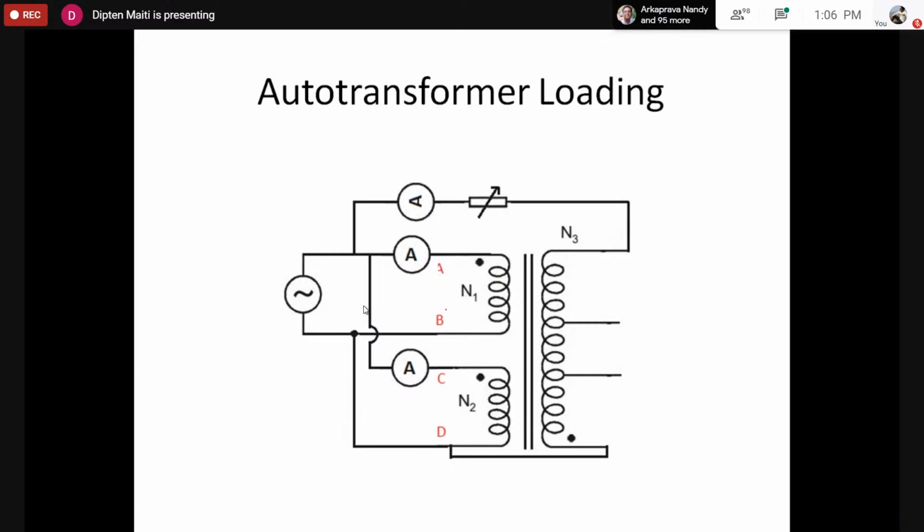That's all. We can connect the transformer as an auto transformer such that we can get a higher voltage from the secondary. An auto transformer is nothing but using the same coil as the transformer. So if you consider one coil like this, and we apply a voltage across these terminals, there is flux produced on the core and the whole coil is wound over the same core. If there are N1 turns and N2 turns, let's say this is V1 and this is V2, we would get V2 by V1 equal to (N2 plus N1) divided by N1. So it's the same coil, and only one coil can act as a transformer.